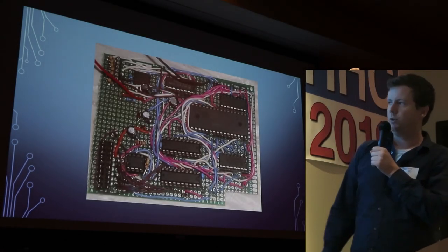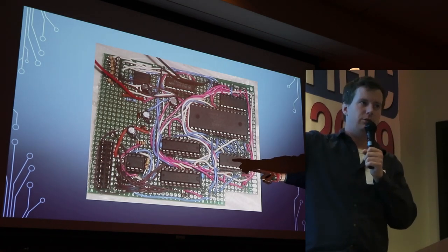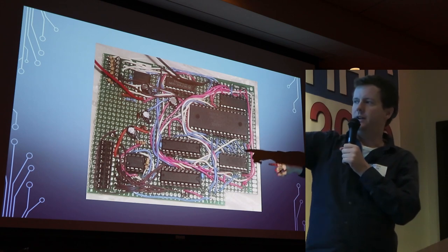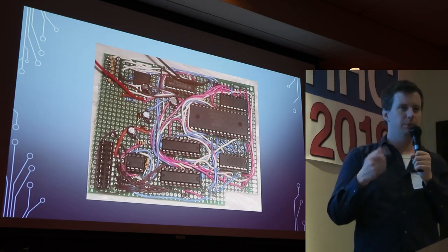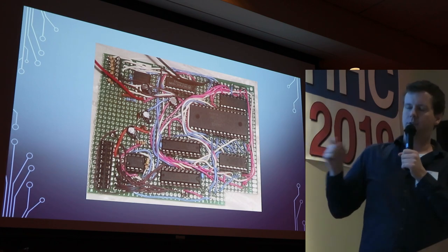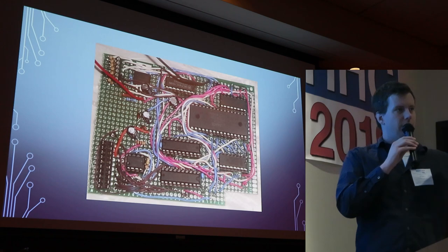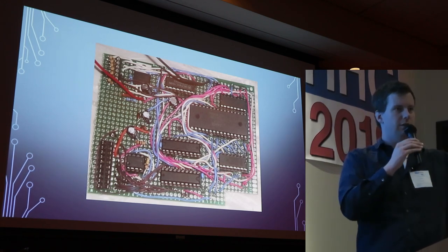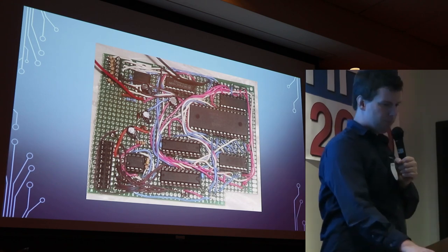This is the circuit board. I couldn't fit the program onto one microcontroller, so I used a second one. This is my big memory chip, and then I thought this was kind of cool. This is actually a negative voltage pump, because the board runs at 3.6 volts, but my LCD is 5 volts. And 3.6 is not enough for the contrast to show anything, but if you feed negative 2 volts into the contrast, that creates a wide enough difference that the characters show up on the LCD.